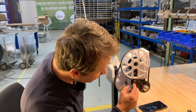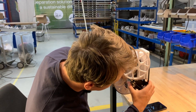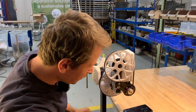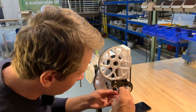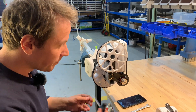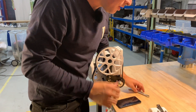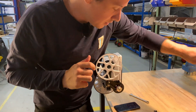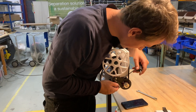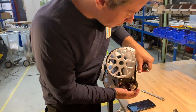We loosen this one and the motor mount here is free to flex and move in a lot of directions. What we can do is secure the lower one — tighten that a little bit like this — and then we're going to need a tool. Let's take another Allen key. See if I can get this one in here, and now I can lever the motor down.